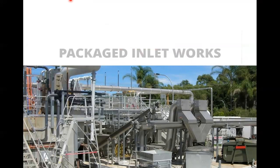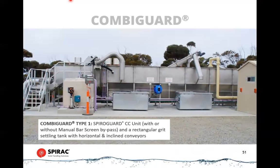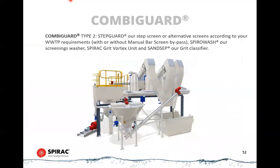Next topic, and I think this is the last topic, is packaged inlet works. I won't go into great depth on this because there's so much detail potentially on these, but Spirac has become very good at doing packaged plants where we provide a turnkey primary treatment plant for a site. And this can be shippable units. So this is what we would call our combi guard unit, which consists of a long grit chamber and a screenings inlet section. Or it can be a built-up system where we use multiple components. So in this case, we use multiple CC units. There's a stainless steel vortex system and a grit washer, all feeding into a skip in this case.